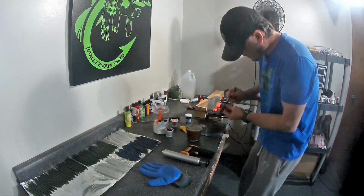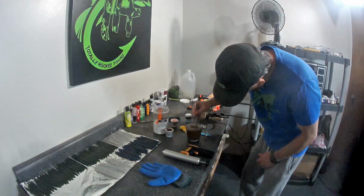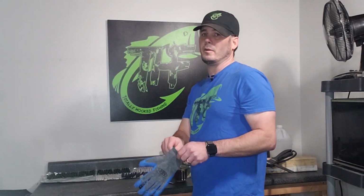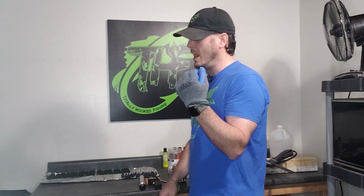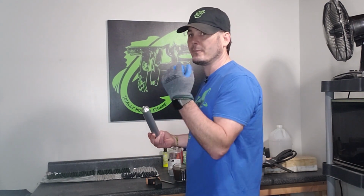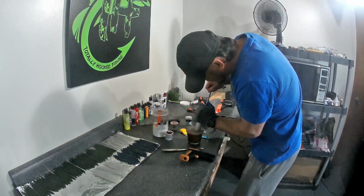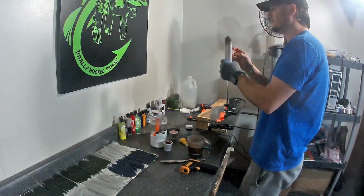All right, so we're just going to hit this with a little more stirring, and then we're going to go ahead and shoot these. Now, I always like to wear a glove because this stuff, like I said, is hot. It's 350 degrees. So my injection hand, glove. Wear gloves, trust me. So we're going to suck some of this up. We'll probably shoot both molds here.